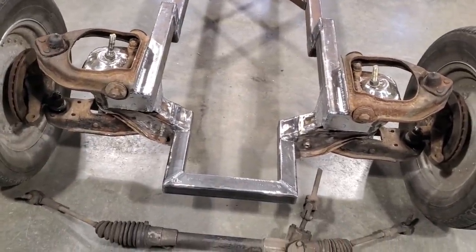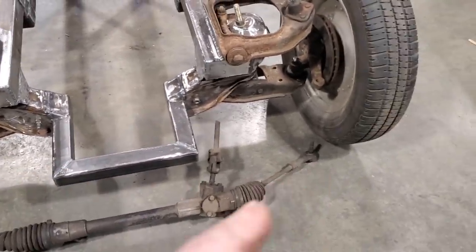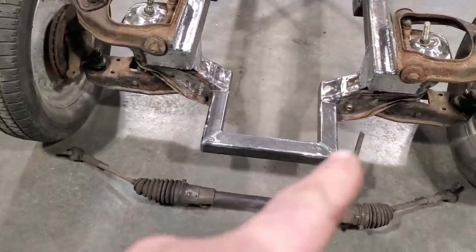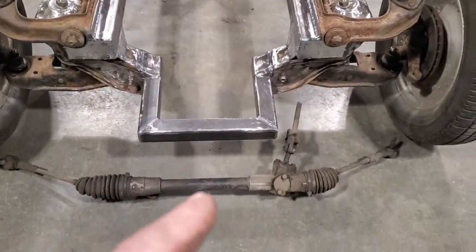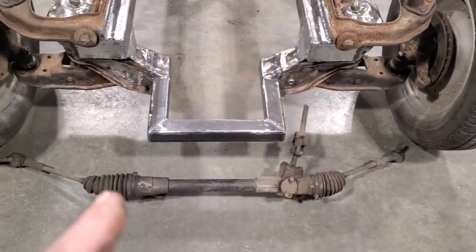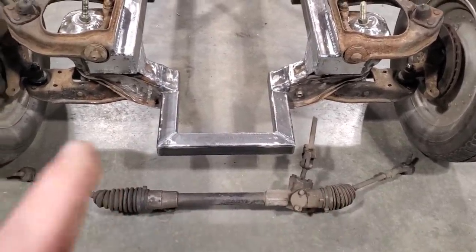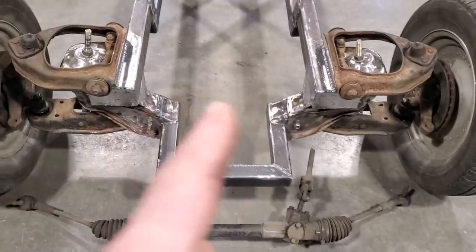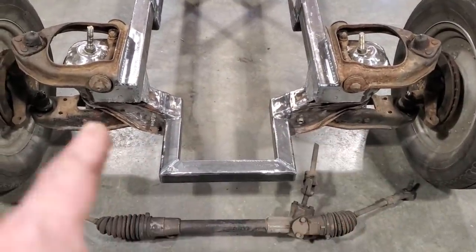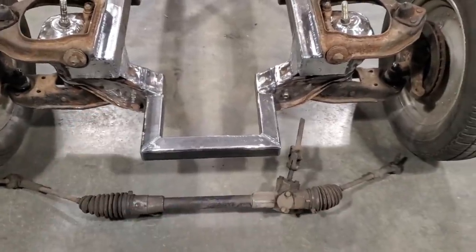A lot of people have asked about the rack and pinion in this. As you can see, with the angle this is going, this rack is going to be mounted across here. I've got to shorten this rack, okay? I've discussed it with a few people, and we figure we can actually knock 4 inches out of one side of it and bring it in the distance, because this is the rack and pinion that belongs to this front end. I narrowed it 4 inches, so if I narrow the rack 4 inches, the geometry should be on.